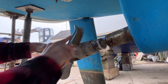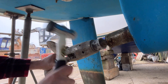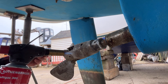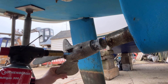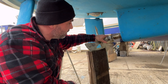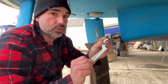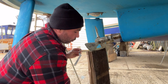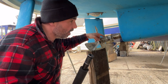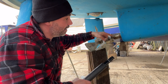Due to the amount of jobs, I thought it was best to remove the propeller and get it in the garage. I wire-brushed the seam, shocked it with a hammer to break the joint, and heated up the collar with a blow torch to expand it, to help ease it off with the wrench. I propped some wood under the propeller to stop it rotating, then turned it anti-clockwise using an adjustable spanner with a bar slipped over the end for extra leverage — being careful not to force it and risk bending the shaft.